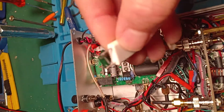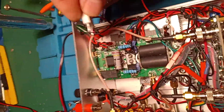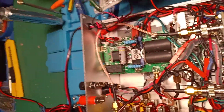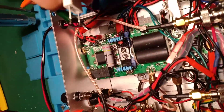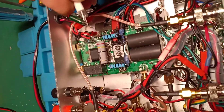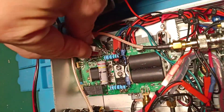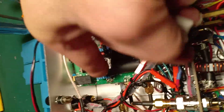I am currently testing with and without this feature to confirm it works perfectly. You can add this kind of resistor to the source on the ground of the MOSFET. Initially I put it like that on both sides — you just need to bend the source pin of the MOSFET a little bit.